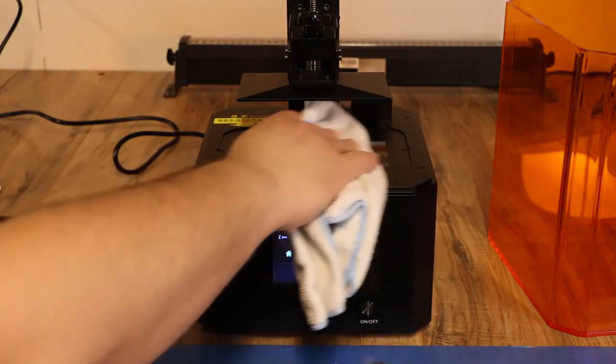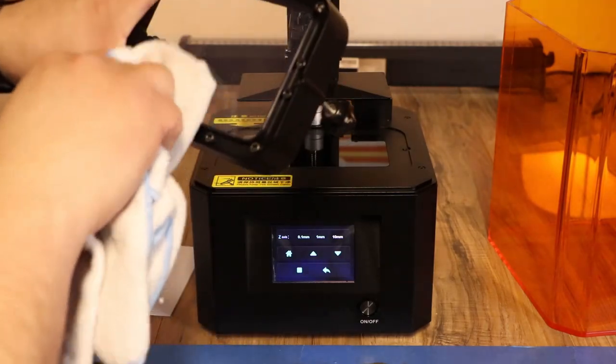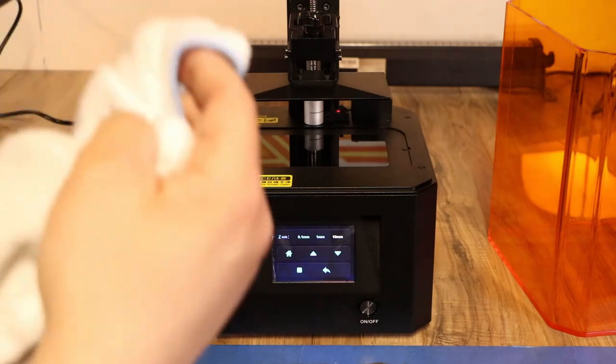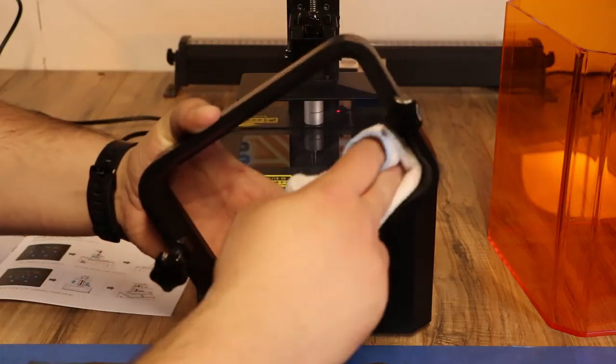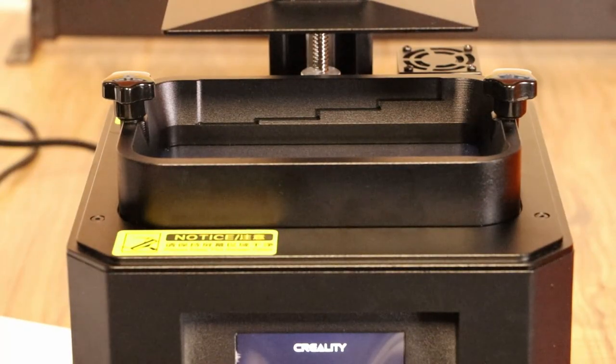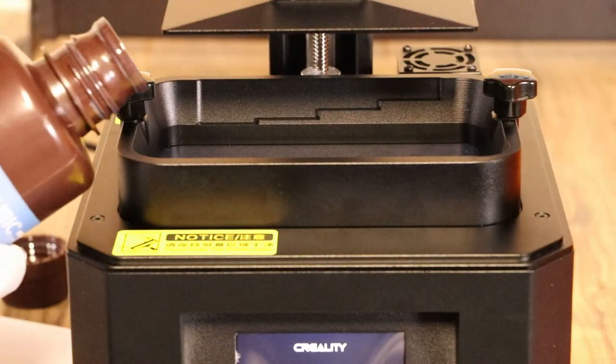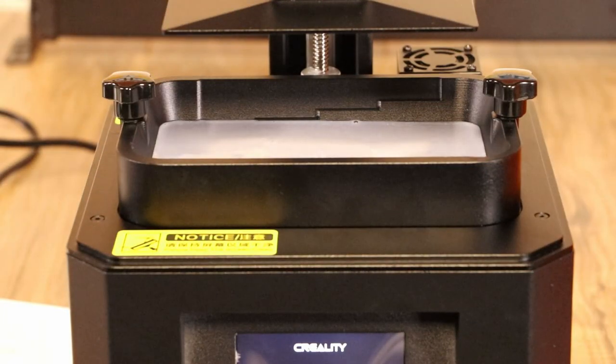Bring the platform back up. I'm going to take a microfiber and wipe the screen down so there's no dust, and wipe the bottom and inside of the vat, because there is some stuff on the inside and we don't want that in our prints. Screw the vat back to the body. Now we need to load some resin. One thing I really like is that in here there are steps — 140 milliliters, then 170, then 225, then 285 — so you can gauge how much resin you put in. I'm going to use my Anycubic Gray resin with gloves on, and I put in about 170 milliliters according to the chart.